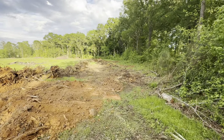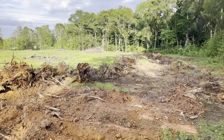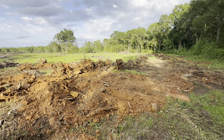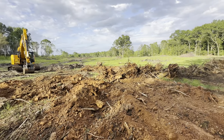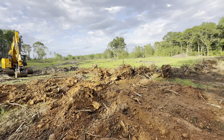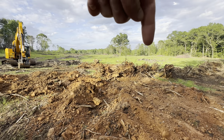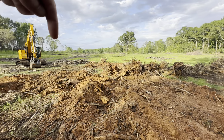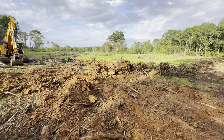And as I get my windrows, as you can tell right through here, it'd be easier for the dozer to push too. Because if you go through and you take some of these stumps and you pile them up in a big pile, you're talking about a dozer that's going to hate life. And so I do windrows, and I'll have multiple windrows, and then I'll just pull from those, and probably somewhere right through there in the center, this whole area will be one burn pile.